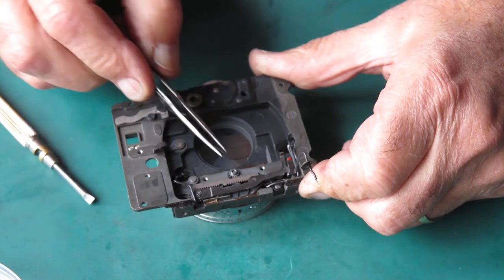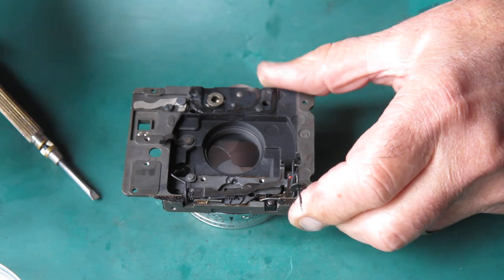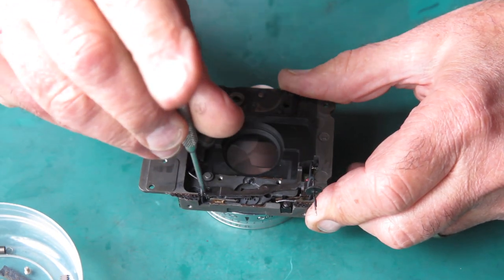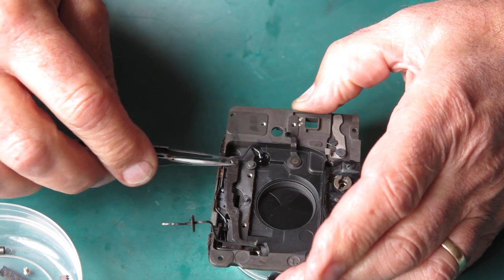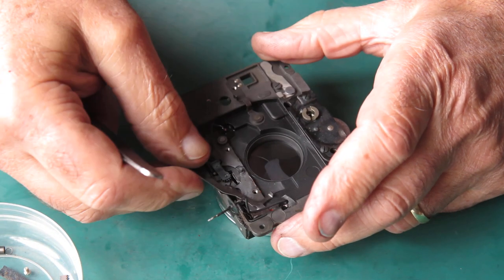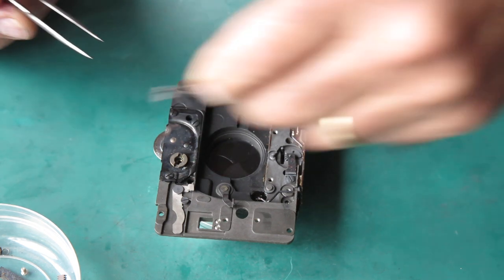There's a pinion here and this little rack. Take a screw here which is usually very tight — that's quite normal. Occasionally you'll find them when they're loose. Pull out that pinion and that little bush that it runs around. I'll see if I can unhook this arm — there's a little plastic insulator on the end of this arm. Sometimes you can't get it tucked in underneath.